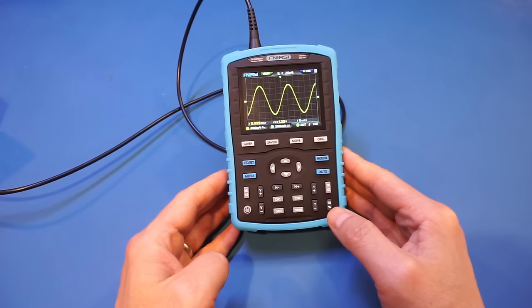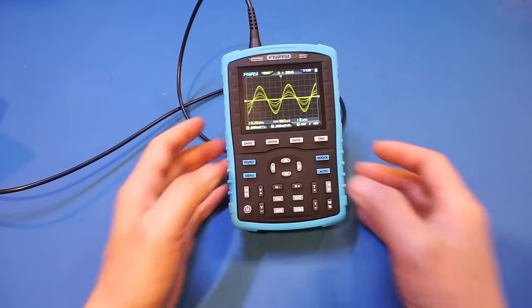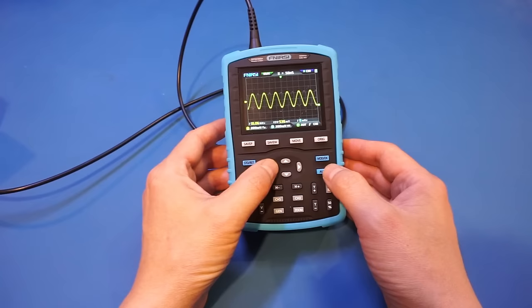It's a 10 MHz signal, and we're going to add some modulation on top and take a look here. And let me enable the modulation. So the first modulation I'm applying here is amplitude modulation at 1 kHz with a modulation depth of 100%. So let me reacquire the signal to see if we can automatically acquire it. Doesn't seem like it, which is quite normal.